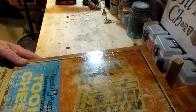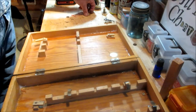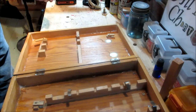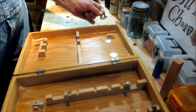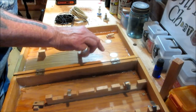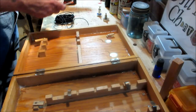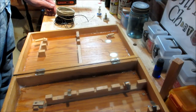I'm going to open up the box and put a piezo here and one about here, hot-glue-gun those down. I'll put my jack somewhere on the box where it's going to be protected and off the floor, along with my volume control. I'm going to cover all the connections, the entire piezo, and the wires in hot glue. Then I'll use this pre-tinned wiring and attach it and make my other connections.